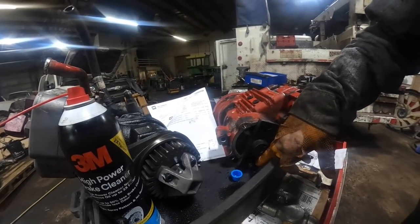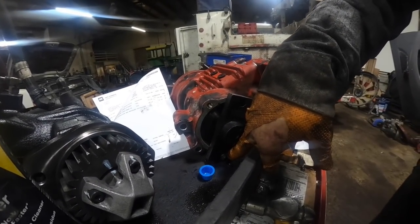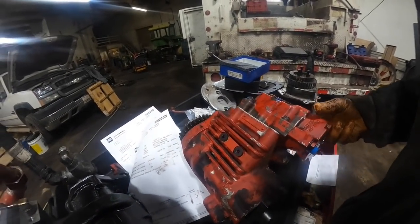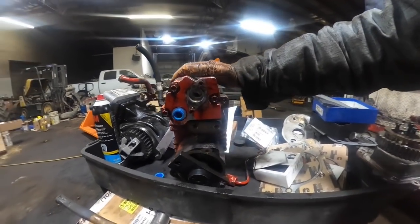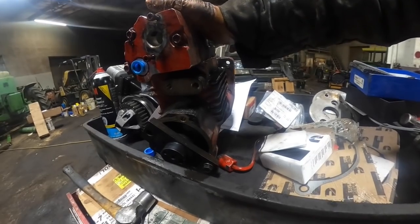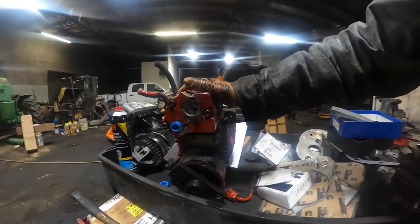557-2562. You'll see it says XPI down here, and see the bolt in the pump. You'll just rotate the pump till that bolt hole lines up with the closest bolt, towards the block. Sorry, this thing, one of the ears is right on the bottom, and it doesn't set up very square. That'll line up with that bolt, and then bolt the timing tool down to it so it'll stay still, and then put the pump in.